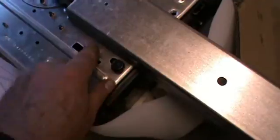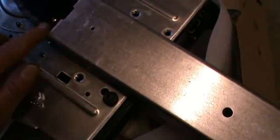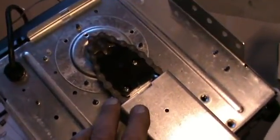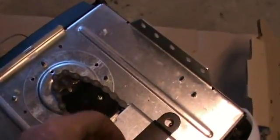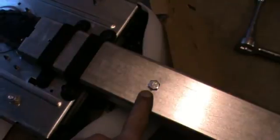Take off the four bolts and lay the rail on top of the power unit. The chain then comes up the side of the chain separator, over the cog, and back down again. To get some play you'll probably need to slacken off the spring bolt at the door end of the rail. When that's in place, put the two brackets back on with the four bolts. This is the trolley stop bolt which goes through the chain guard with a nut at the back — tighten it to stop the trolley going too far back.